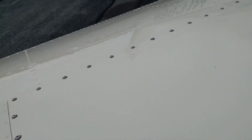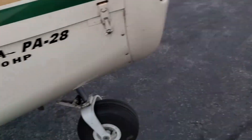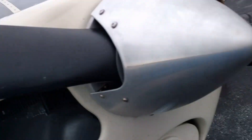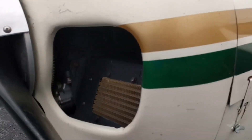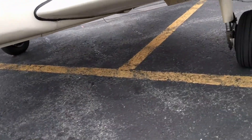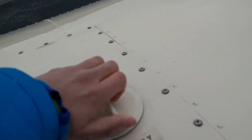Check how much fuel there is — that's good. That's the engine for now. Look at the leading edge — looks good. There's no bird nests or anything inside the engine; sometimes that happens. Landing light is on, landing light is on. Tires all look good. Underneath the plane, the struts look good. Leading edge — let's check how much fuel. Looks pretty good. And just make sure that nothing looks abnormal.